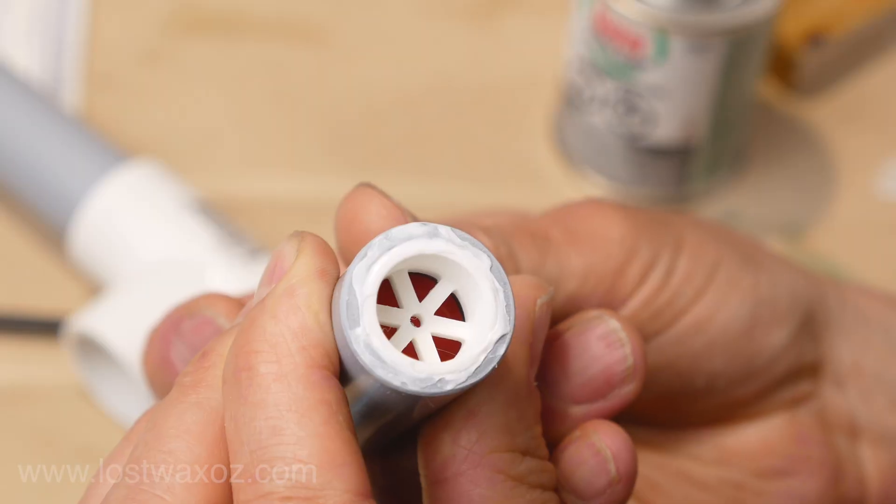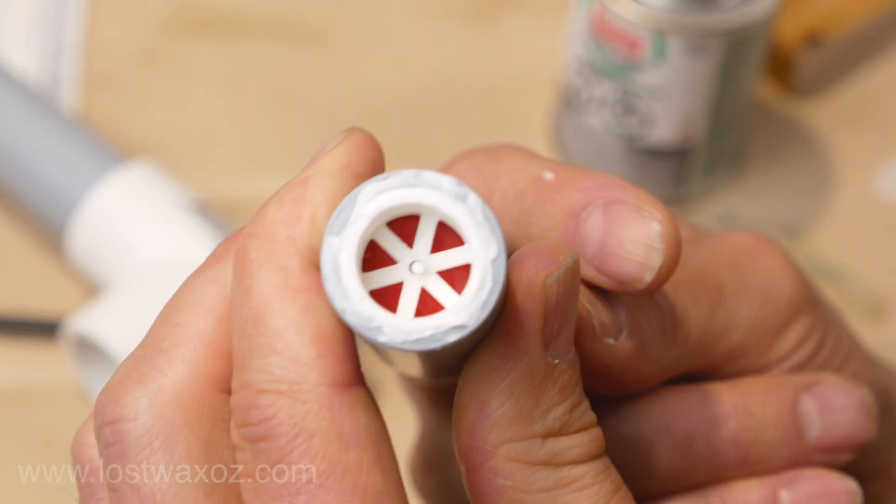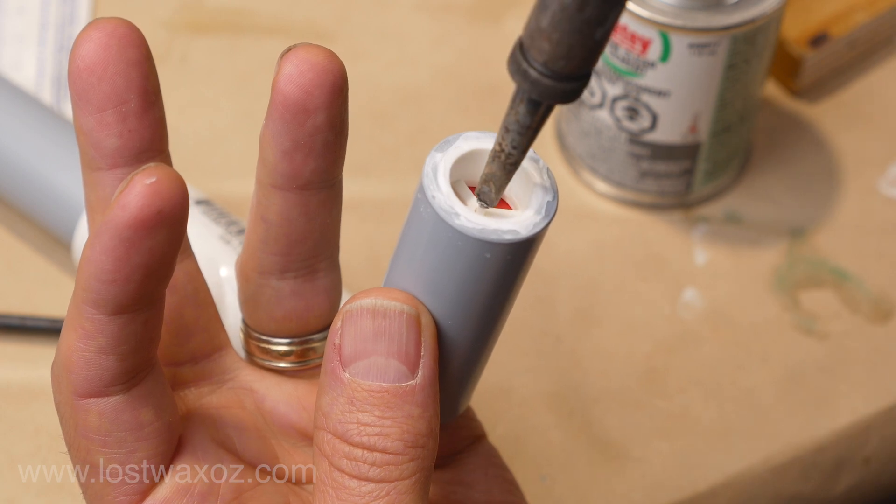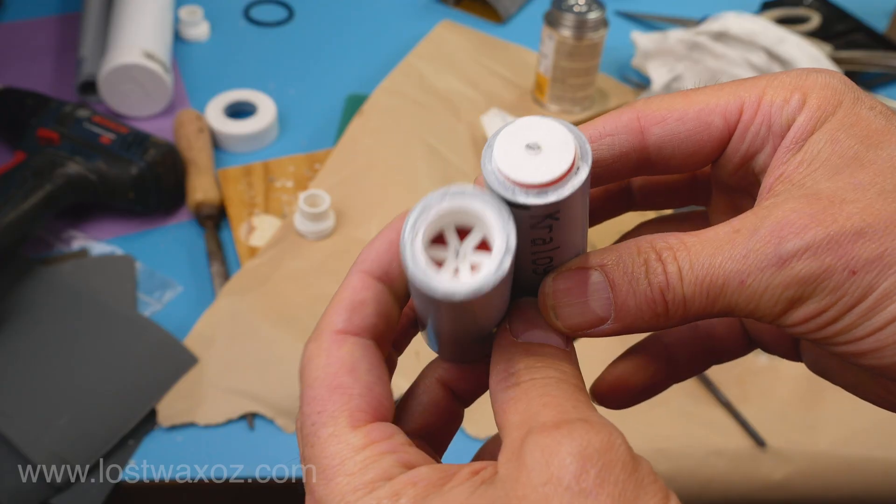Now the valve on the other handle goes in the opposite way. I didn't want to get glue on the flappy disc, so it's not installed yet. I applied glue only to the back end of the valve body and pushed it in until it was flush with the end of the pipe — the main thing I'm looking for is no air leaks between the pipe and the valve. Once dry, I grabbed the disc, slid it up through the back, and holding it up with my little finger, mushroomed the end of the rod with my soldering iron. And there we go — two simple valves.